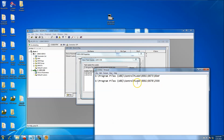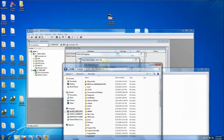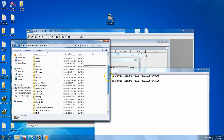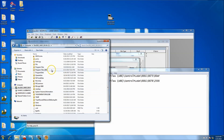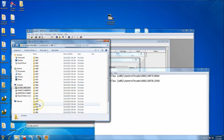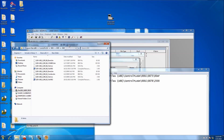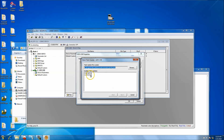What I did is I navigated and found the flash file I needed. If you go through and find where your flash files are stored, you can locate it. Your Control Flash software does this automatically, but if you use this Drive Executive method, you'll need to browse to the file manually. I now have both firmware versions available to choose from.